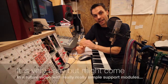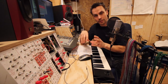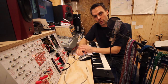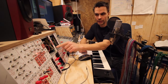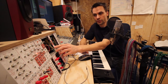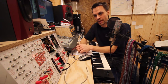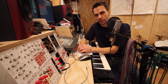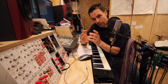Today: filters. We're going to start with a pretty mellow filter — no resonance, just CV-controllable frequency. It's the PIA 2720-3L, which is a low-pass filter from the early days of PIA. I believe it is one of their first modular synthesizers, the 2700 series. There's also a 2720-3B bandpass filter, but today we'll make the low-pass filter.